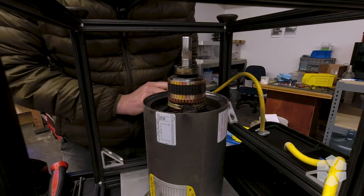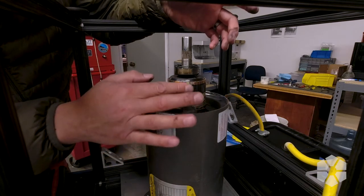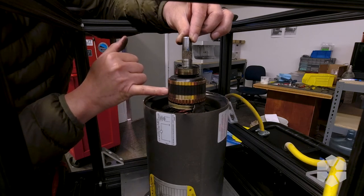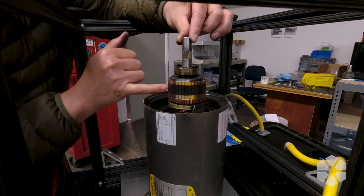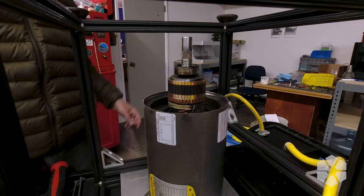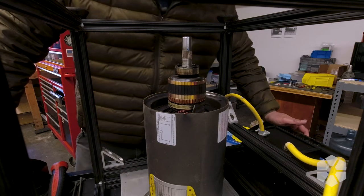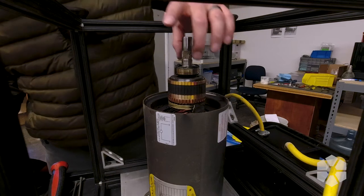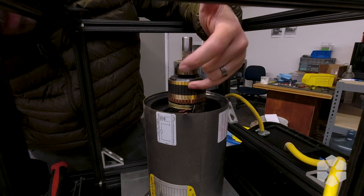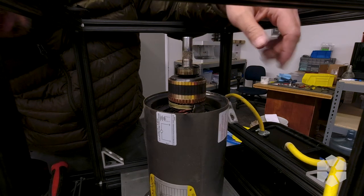What do I see? I'm not even sure. There's definitely a lot of carbon in here, and the carbon is from the brushes breaking down. The commutator's totally black, as you can see, which it should not be — that should be nice and shiny. Why it turned black is the real question I can't answer. I don't know what causes that, other than arcing. I'm probably gonna have to chuck this on the lathe and try to clean it up with emery paper. However, if that is insufficient, I'm actually gonna have to turn it — which is fine, because I have a lathe.